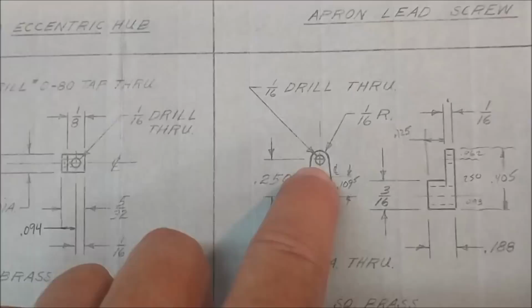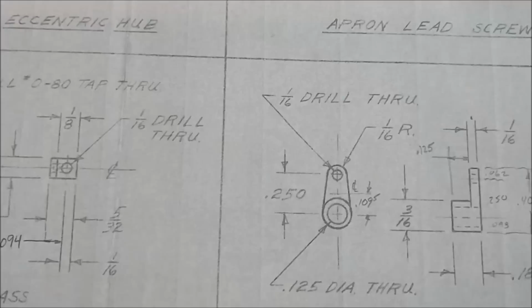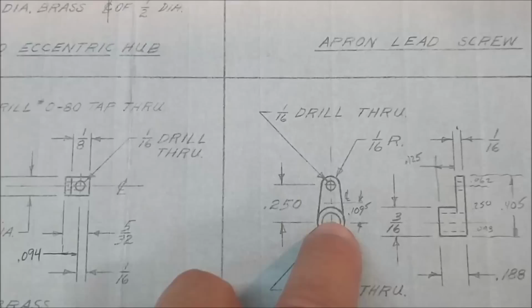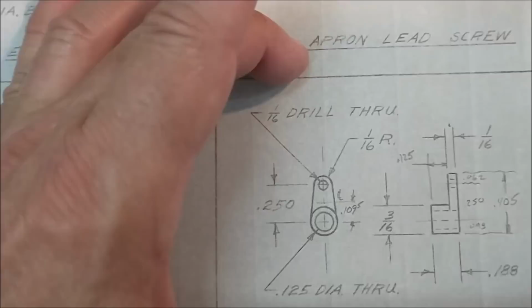Where I want to be is directly over the center of this guy right here. So instead of dialing off center with the XY controls on the bridge port or on the mill, I'm going to have to shift from the center point of the material about 110 thousandths off center. And I will do that by putting 110 thousandths worth of blocks or feeler gauges or whatever you have against the back of the material, or against the back of the vise, excuse me, and shift the entire vise one way or the other.